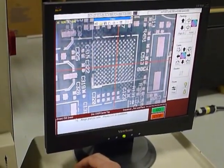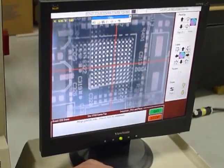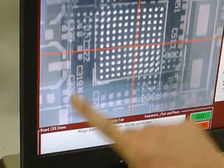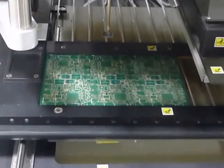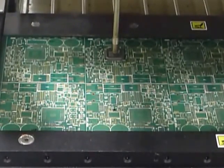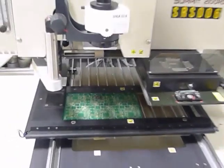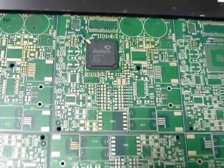That's one of the SRT features — that's the part, and that's the board. You play with the lights until you can see the overlay. We'll turn the board down a little so we can see the part more. We jog to line up these corner pads, and you can see how the whole pattern lined up. We say go, and the machine is well in calibration — you can see it lined up to the corner tick marks.